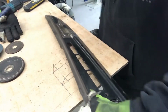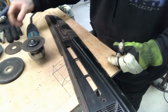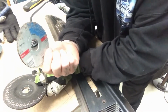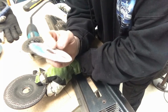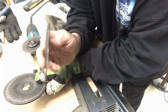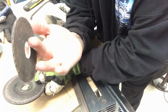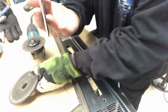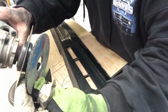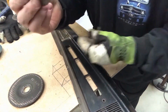I just also wanted to show you, obviously I've got the grinder, grinding disc. Before 1mm cutting discs came out, these 3mm thick horrible bastards, pardon my, well it's English, used to be what we use for cutting. I don't know if you can see that, it's crazy thick compared to a 1mm disc. But what I use these for is grinding.